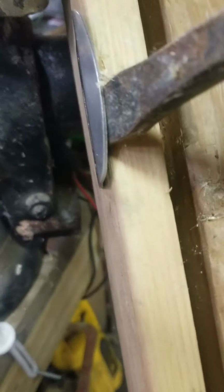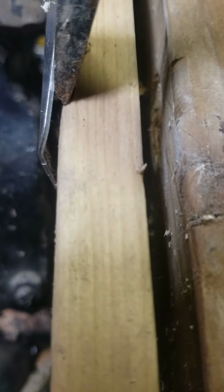With some force, you see it flexing there. I just put these screws in, and it's in a new board. Not too much force, but see how easily that's going to pop out. All right, so that's where the 3.5-inch screws come in.